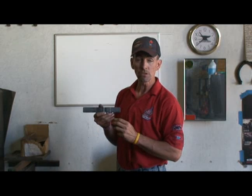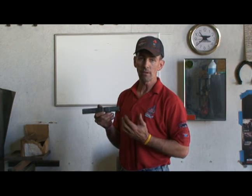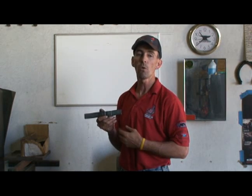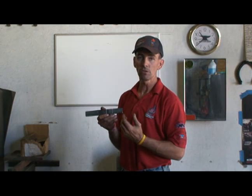The way I'm going to make this shoe is I'm going to use a cross peen. Probably the thing that makes this shoe so hard is you have to stay on the very, very tip of the horn the whole time you're working the lateral aspect of the shoe.